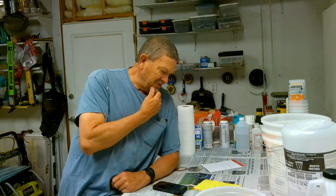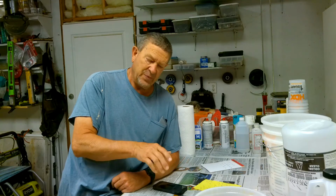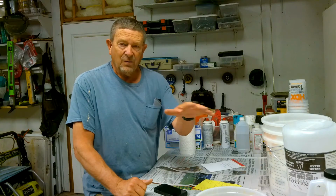In the case of this countertop, when I plugged in the numbers, it came up with 1.64 gallons. It is 20 square feet per gallon. So it came up 1.64 gallons. Then on your phone, you can get an app that will convert gallons to ounces, which in this case, 1.64 gallons was 210 ounces, and then you divide that by 2. So 105 ounces of resin, 105 ounces of hardener. And then you know what to mix.